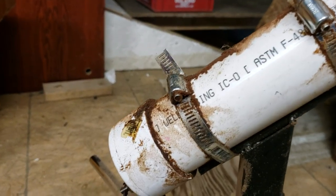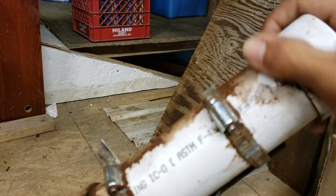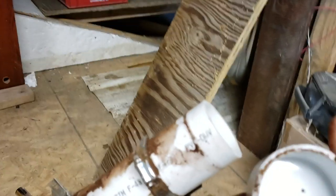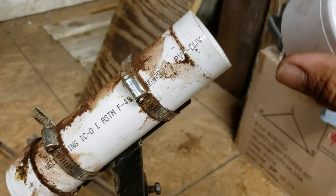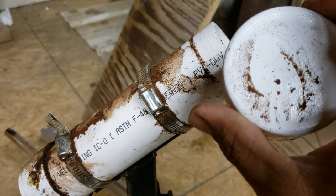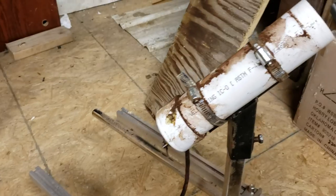On the top cap — if I can get a good enough grip on it, it's kind of oily — you need a small hole drilled in it. That's to let air in. It gets clogged with sawdust so you have to blow it out, but that hole lets air in so that the oil can come down.